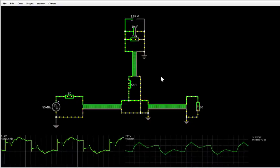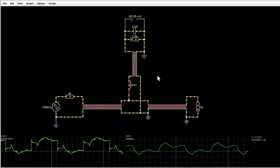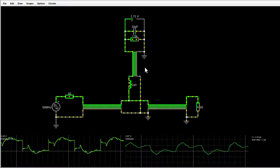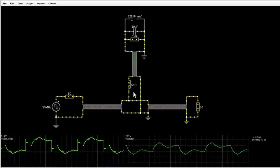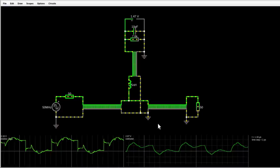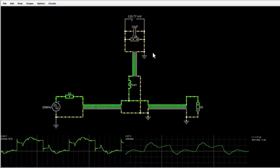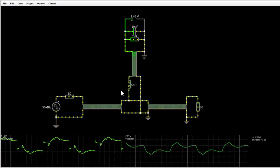You might be wondering whether the DS Logic's coaxial probes are actually an improvement over traditional flying leads. My sense is that it probably is an improvement — we get a nice consistent frequency response across the frequency range from the 50 ohm characteristic impedance rather than massive inductive loads that vary with frequency, and we should also get less phase shift applied to the device under test. If the coaxial arrangement is causing a problem, you can always take it off and do a custom probe setup by attaching directly to the header.